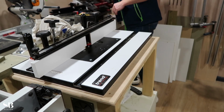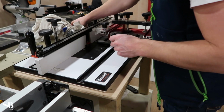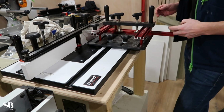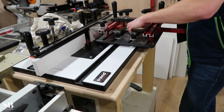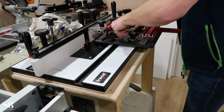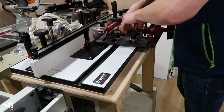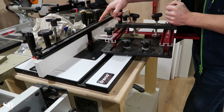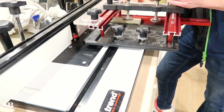Well, it's a sled, so it's quite a big contraption just to cut this end piece, but here it is. So all of this contraption, well, it looks quite large, and it is quite large, its main purpose is to hold this absolutely perfectly right angle. So we can lock this in. So that's all locked in. Because if you imagine when you're running this across, this is running at ridiculous speed. That wants to obviously spin and flip this out, so this is why everything is locked in.